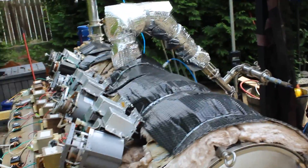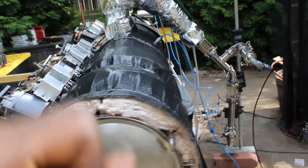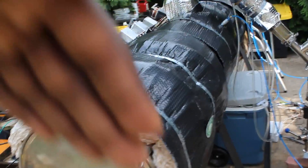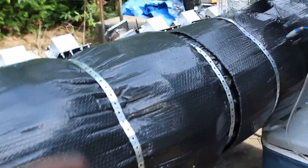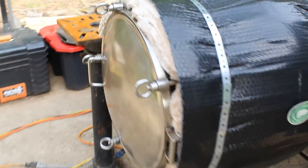After the plastic is put in the machine, microwaves hit it and the blades spin the plastic. As they keep spinning the plastic, it allows the plastic to keep being agitated and have maximum contact with microwaves, so no uneven heating happens, and the blades also simultaneously move the plastic down the machine. Once the plastic reaches the end of the machine here, it's going to fall down the chute. But it's no longer plastic by that point - it's been hit by so many microwaves and completely degraded, all of the oils and energy liberated from it. It's just been reduced to carbon and minerals, and those carbon and minerals come out here.